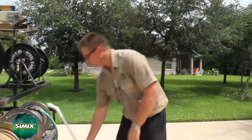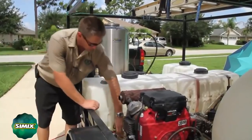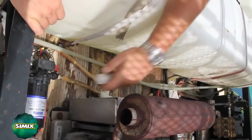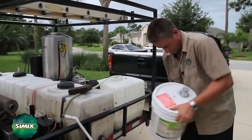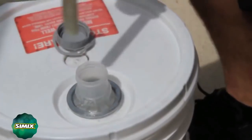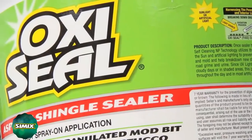How we would do that is we would come over here to your SureFlow pump. You go to your intake and disconnect it. You would take this hose that you've got set up here — it's just got an intake fitting and is open on one end — and connect this to your SureFlow. Then you would drape this. After you have shaken vigorously and used the paddle to mix the TiO2 back into suspension, you would ultimately drop this down in here. Once this pump feeds into there, you want to let all of the material in the line of your SureFlow cycle out until you have nothing but the Oxy-Seal in your line.